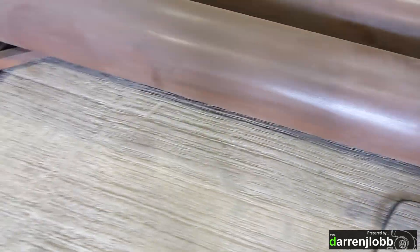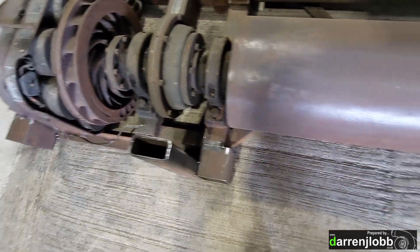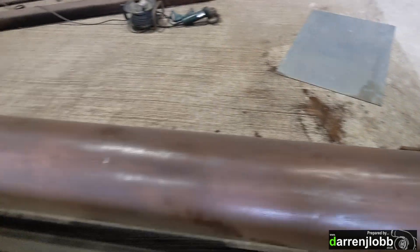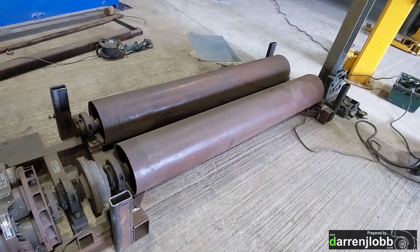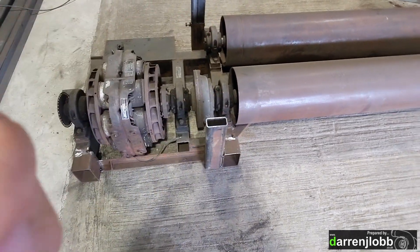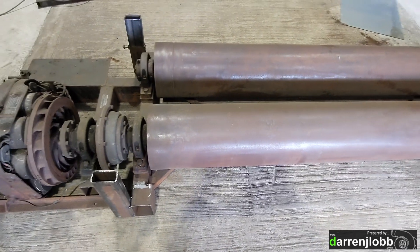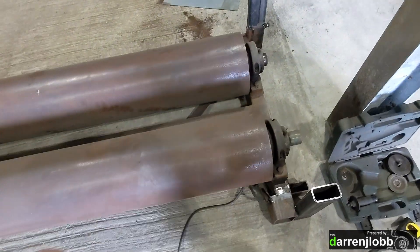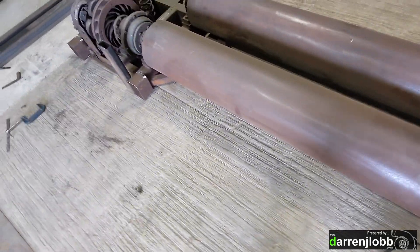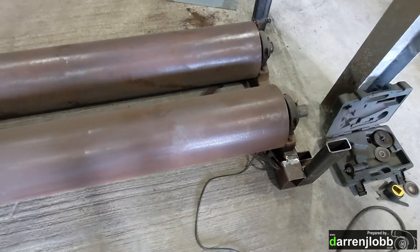I've just tacked on those three extensions on the original chassis, bringing those front three legs out parallel in front of the rollers, which is where we need to be to build the framework. I've also tacked on two uprights on the front and extended the uprights on the back, which gives us the box around the roller frame. I'll just get everything tacked at the minute, measuring to make sure it's all square. It's pretty critical to get everything square on these, particularly now that we're going to have two beds, because I'll be linking them together using the front edge of one and the rear edge of the other. If that isn't square, the two sets of rollers won't be in line with each other.